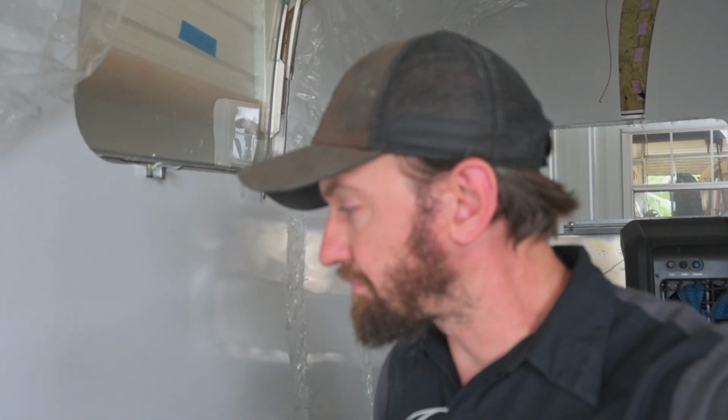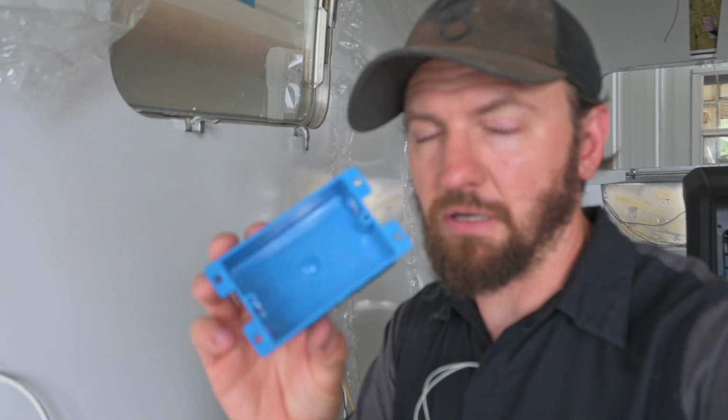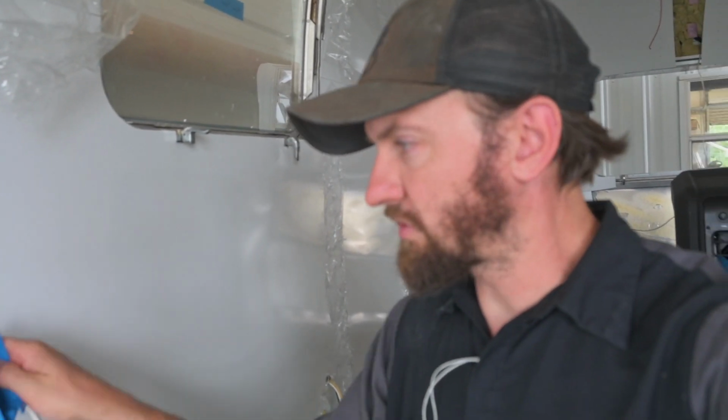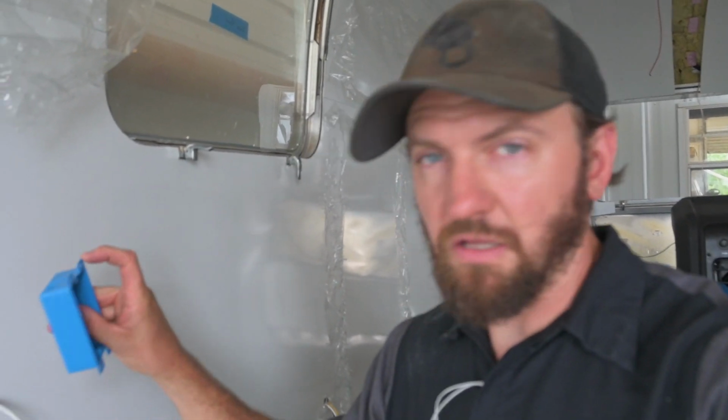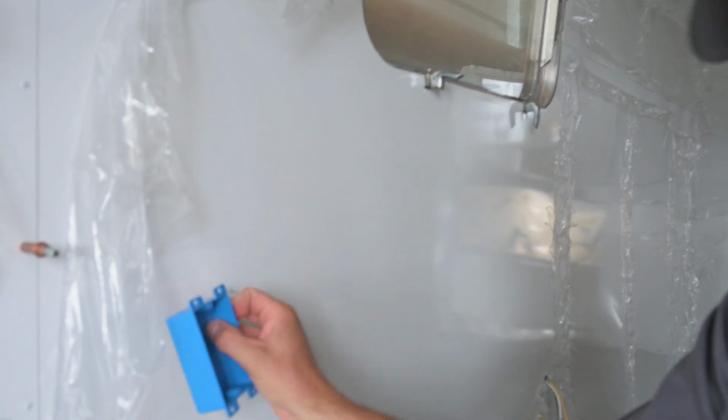countertop. And whenever we're putting, say, an outlet directly in the wall, I use these shallow plastic electrical boxes, and you basically just cut the hole, slide it in, and screw it into the skin itself. Obviously there's no hole here, so, and then run the wires through and put the socket in there. And you can do the same thing with switches and everything.